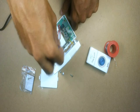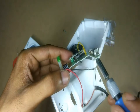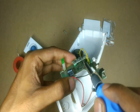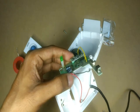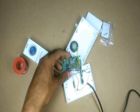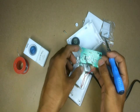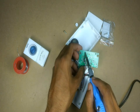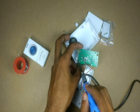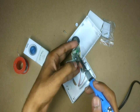Next, the important thing is to find out the trigger which is coming from the transmitter to this receiver which is generating the tone. Here on this circuit I found a small module which seems like the receiver module. It has 4 pins — with a wild guess I can say that 2 of them can be power supply pins and the other 2 can be a trigger and an antenna wire. This small module is connected to a big board which also has an onboard antenna, and this big board can be the tone generator IC circuit as it is directly connected to the speaker. So the trigger comes from this wireless small module which is connected to this big circuit where the tone is generated.